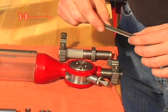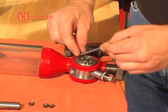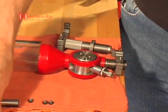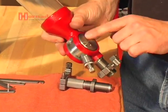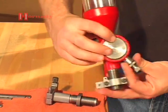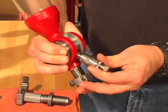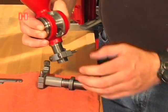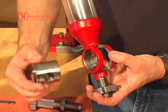This is the actuator arm. To completely disassemble the powder measure and take the rotor out, that arm has to be off so that the rotor will slip out. The next step is to press this detent, slip out the powder metering insert, and then the rotor will slip out in that direction.